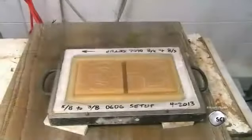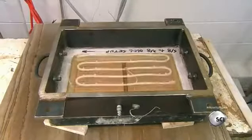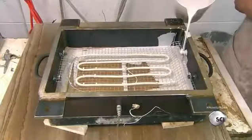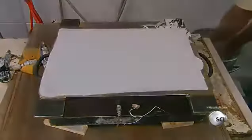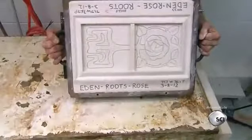To make the fireplace's ceramic tiles, they produce a rubber mold of 2 adjoining tiles and place it inside a metal casing. They also include a release system to help with extraction. They fill the casing with an exceptionally strong type of plaster. It sets in about half an hour, taking on the shape of the rubber mold. This plaster casting is the die they'll now use to produce the tiles.